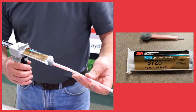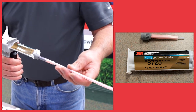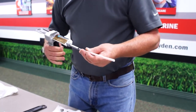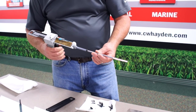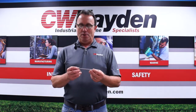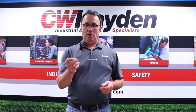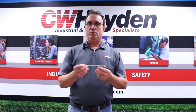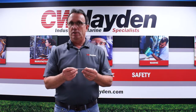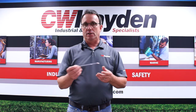We'll fill our last straw, and once all the adhesives have a chance to kick off and solidify, we're going to cut away the straws and show you the various flexibilities and rigidity of the various epoxies that we have here — and there are many others as well. Enough time has passed where all the adhesives have solidified in the straws, so we're going to cut the straw away and go through each adhesive to show the different flexibilities, from rigid to very flexible. Depending on what your substrates are, we will hopefully get you the appropriate adhesive.